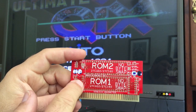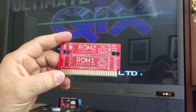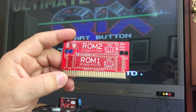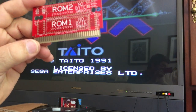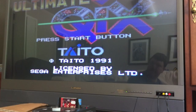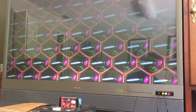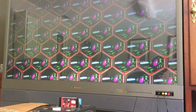The kit requires more capacitors and parts, but not everybody's going to want a kit — a lot of people just use this as a single. That's about it — it gives you a good rundown of my Genesis carts and their capabilities. They can be as simple as one game with almost no effort to make, or if you want a multi-game and you know how to do that, you can buy the kit that has all the parts you need to make the multi, except for the EEPROM.